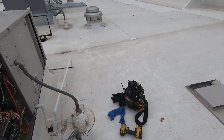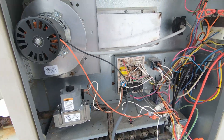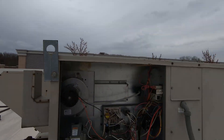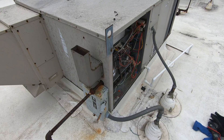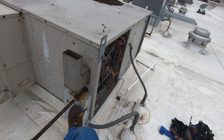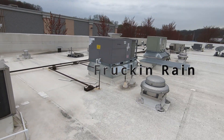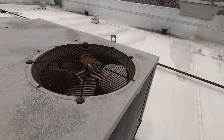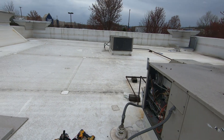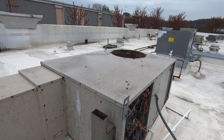Give this thing a general inspection here before I flip the power on, make sure nothing crazy happened. It's about to start pouring. I believe get these filters changed, check the blowers and we'll cycle them in AC. All right, let's give it a whirl. Nothing went boom. Rain — I might have to get my rain jacket. Wires on the condenser fan look good. Let me get the meter out. Hopefully this rain passes quickly. Making this quick — I got R, Y, and G jumped out.